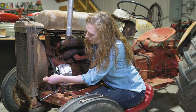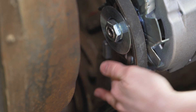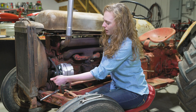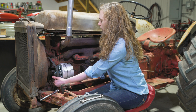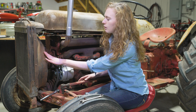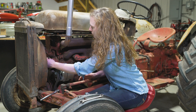I've got that in, and then in the bottom there's a new bolt that comes with your alternator kit. I slide that in, and then on this side you'll go ahead and put your washer and nut. It's important that you drive the bolt in this way so the threads aren't sticking out here on the end. When you replace your belt, you have to slide it around the fan. If your tractor still has the shroud on it, it'll be a little more challenging, but at the top you can slide the belt around every single fan blade. Roll the fan around until you get your belt into place and replaced.